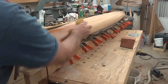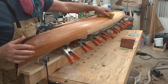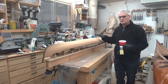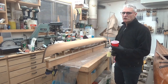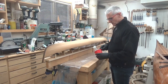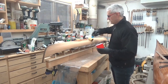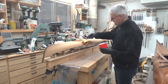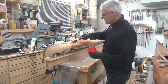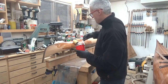I'm going to wet it down one more time and then do the final sanding with 120. The final sanding is all complete on the little scale model kayak — it's ready to put a coat of epoxy on. I'm simply going to roll it on, putting my roller right into the cup and rolling it right on. I've got a piece of plastic down on the table to protect against any drips. I just want to get a nice even coat and let the wood soak it up — kind of just slopping it on there to start.